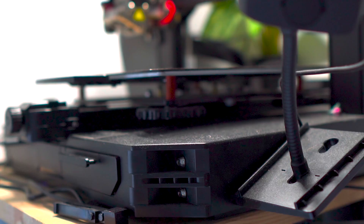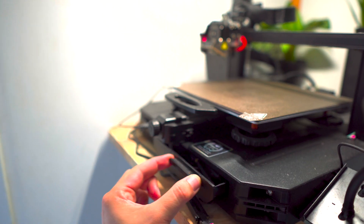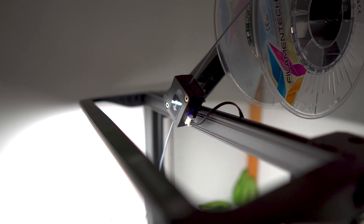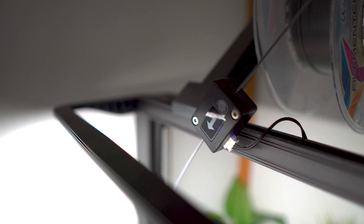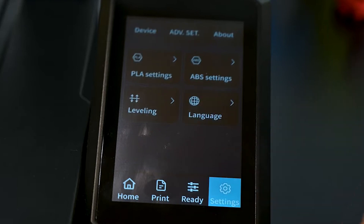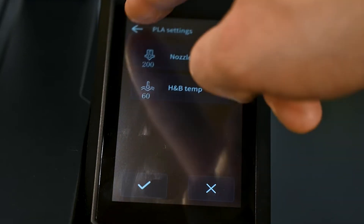The base is injection molded plastic with a little drawer for your tools, which gives it a premium feel. It comes with a light on top, which I find very convenient and useful for getting a really good look at that first layer. The S1 Pro also comes with a filament runout sensor that lets your printer pause and resume a print using the 4.3 inch touchpad interface. This is a game changer if you're coming from one of those old knob-and-dial style printers, and it has a really clean, easy-to-use UI — all running off a powerful 32-bit board with integrated Marlin firmware.